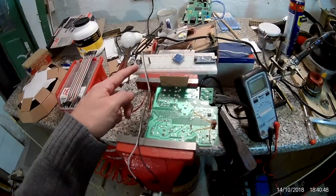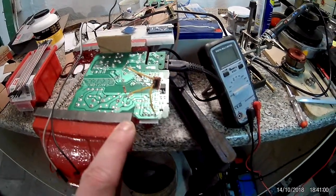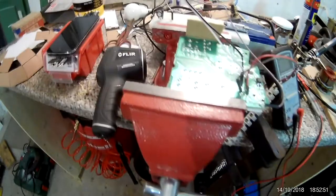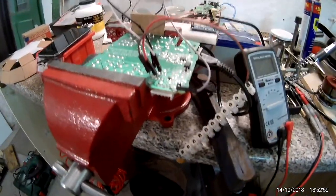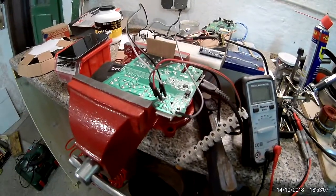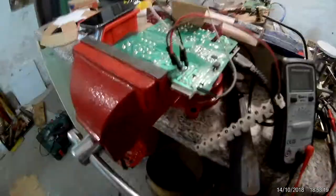Apparently I was right and wrong — this is not analog, it's digital. At some point when I turned the pot, it just jumps up to 24 volts and stays there: jumps from 8 to 24, and on the other rail from 12 to 36, with no wiggle room. I can't just turn it up to get a higher voltage, but I can at least turn it on — and maybe then I can also apply my little hack over the opto-isolator.